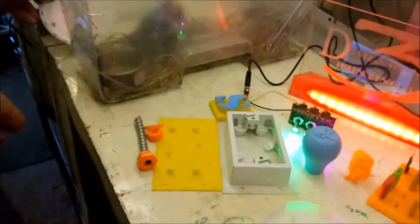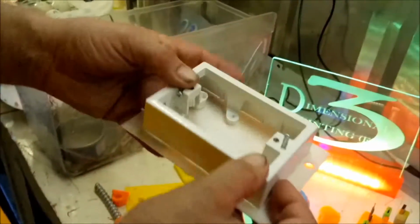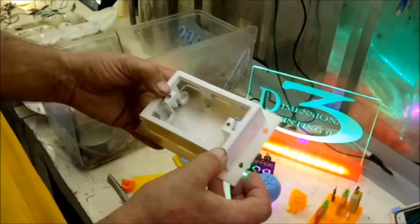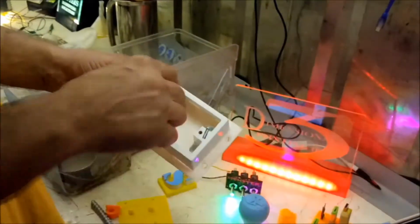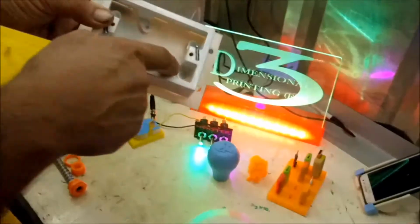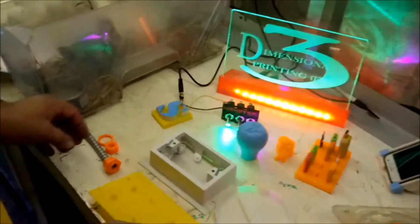Okay, here is when these electrical blocks are mounted on the wall, the ants can get in usually, even the lizards go in, lay eggs. And if someone wants to paint or move the power point or light switch, they have to go inside, take it apart. So it's much safer to make a backing plate like this. Then these tabs get melted to secure it. And then it becomes safer and more convenient.